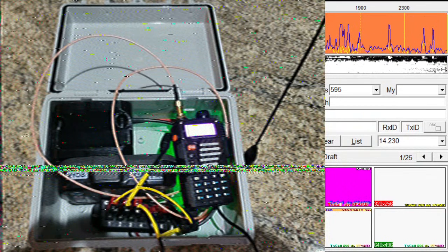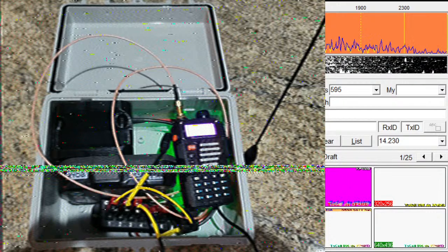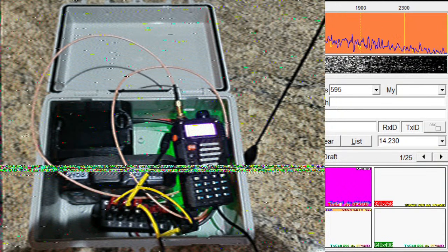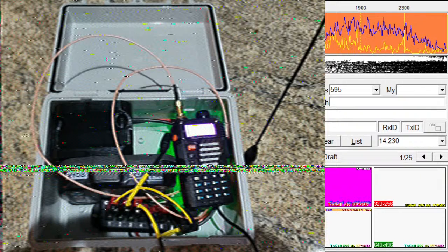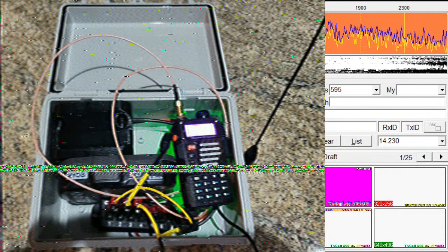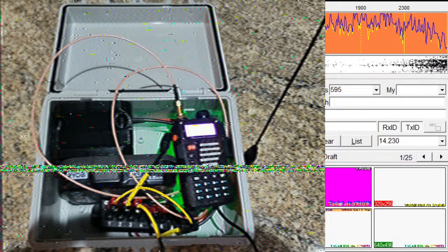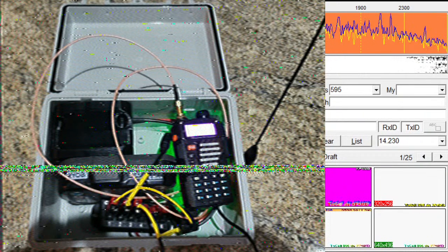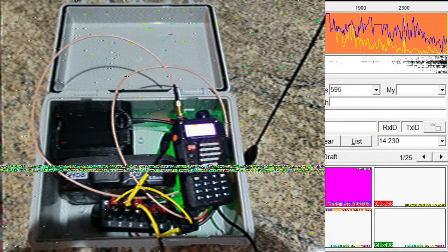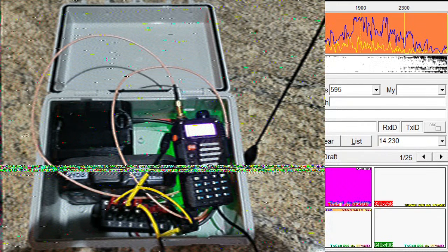Oh, okay. I'm curious, what kind of computer do you have there? Is that something like a single board computer, like what do they call a Raspberry Pi? And do you have it sending out voice messages for the direction finding? Yeah, it's a single board microcontroller, so it's not even a full operating system, but it's configurable, and I can give it a call sign, and it plays some audio tones, and it plays the amateur radio station and its ID, and I give it some config, like how often to play. So this one particular is programmed right now. It plays 20 seconds every minute. So once every minute, you have 20 seconds to hone in on the location of the fox and try to find it.